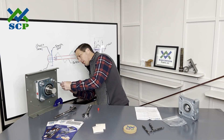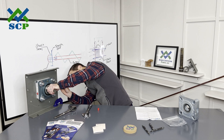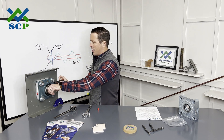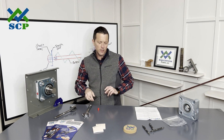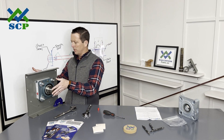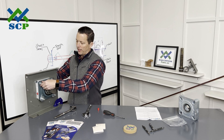Now we're going to go ahead and tighten up — rotate the shaft so we can see our band clamp adjustment. Tighten that up so it puts pressure on the shaft, ensuring that our rotor is turning with the shaft and we're not getting any slippage. When that's tight, presumably this would be in your screw conveyor, all bolted down, and then you would go ahead and tighten all your hardware.